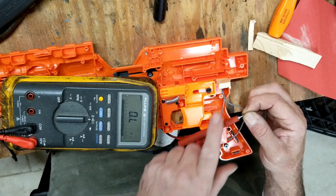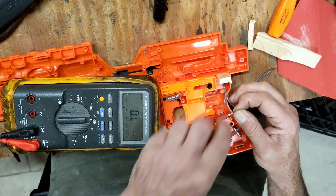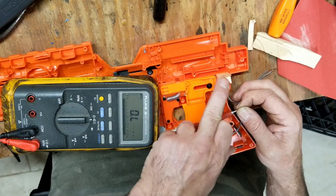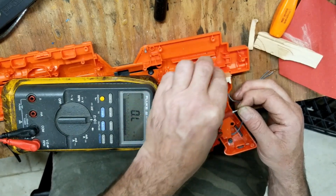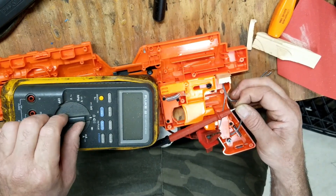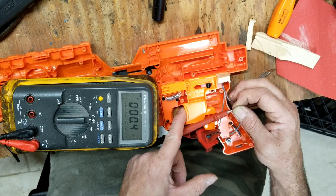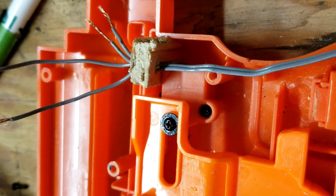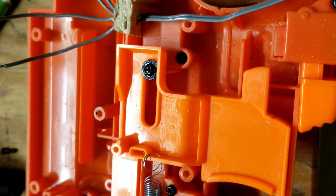It just took five minutes to shave down a piece of wood. You can see on the ohm meter — a nice hair trigger. That should be just about enough where I can put the other cover on and it shouldn't interfere. I'm gonna drop some hot glue down in there and that should be good. The trigger stop is installed. I also realized I had to run some wires through it, so I drilled a small hole. I have just the amount of trigger travel I want right now and everything looks good.